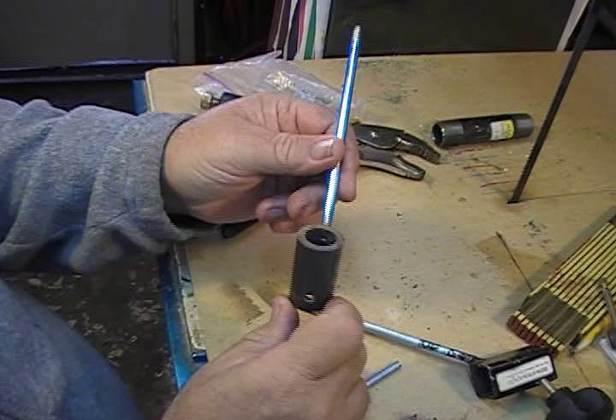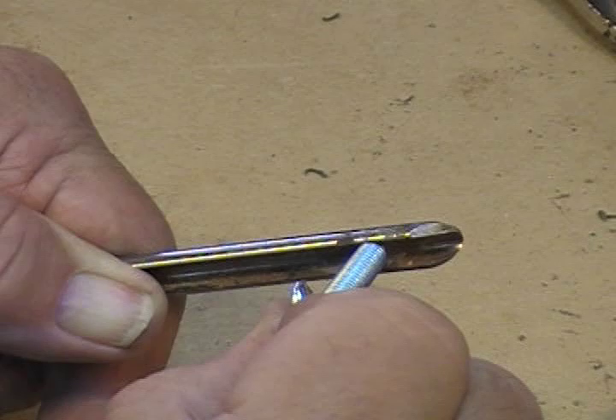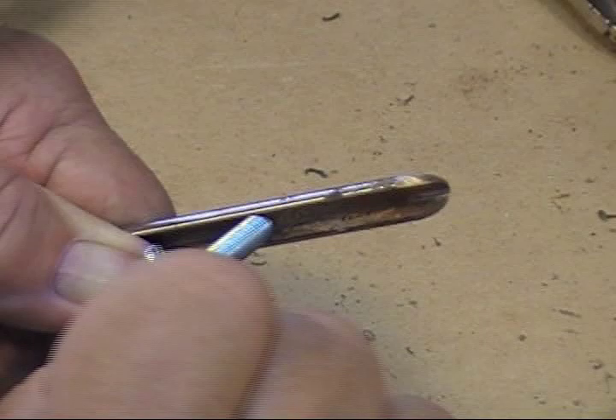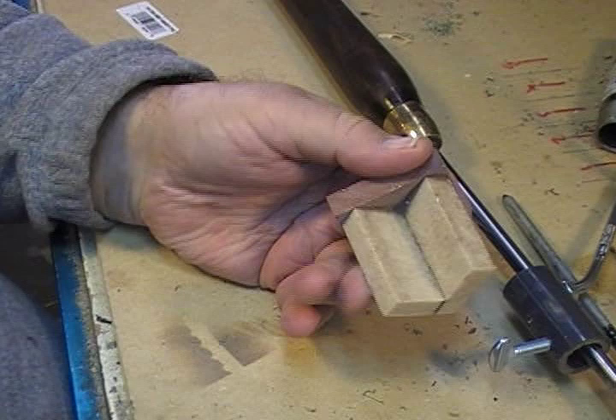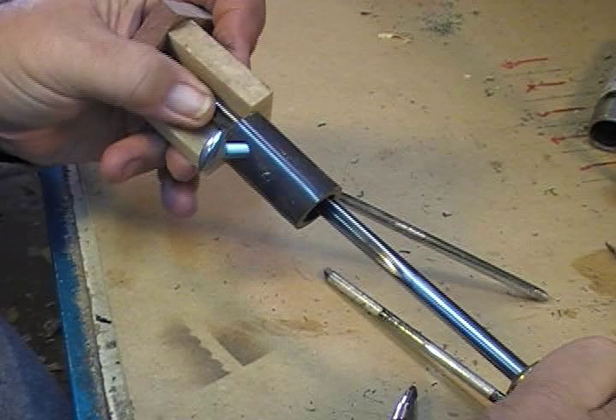The thumbscrew needs to be altered a little bit. If you put a regular thumbscrew down into the bottom of this quarter-inch wide gouge, you will see that it will wobble around a little bit. So I'm going to take it over to the grinder and custom fit it to fit down in the bottom of that gouge. See how I pencil-pointed it a little bit? Now put that in. I saw this in the catalog the other day for $10 — this is a gauge you use for setting your tool 2 inches out of your gouge. You put it in your gouge and set it 2 inches. Remember the 2-4-7 math.